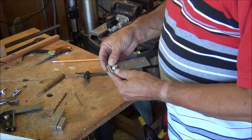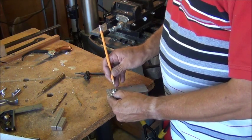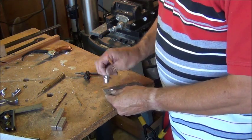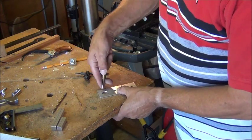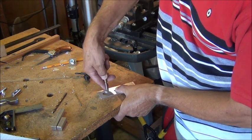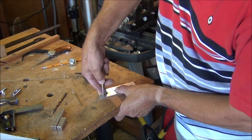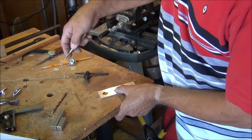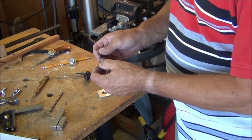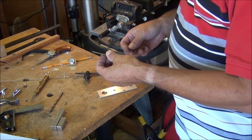The first thing I'm going to do is just set this in here, square it up, and mark the holes where I'm going to drill, then center punch those holes. Since there are 6-32 screws, I have a little chart that shows I should be using a .107 drill. I didn't have that but I did have a .106, so close enough. I'll go ahead and chuck that up and get it ready to go.